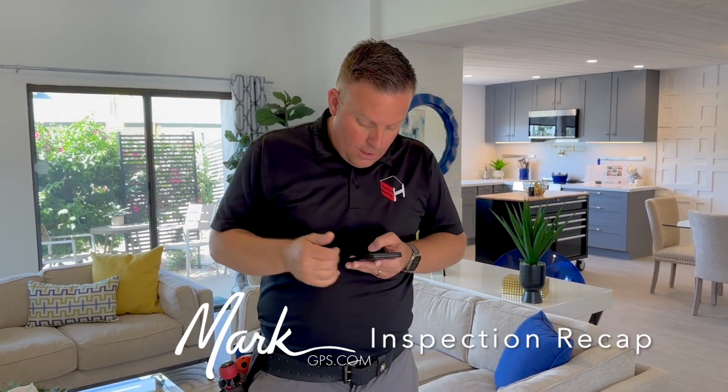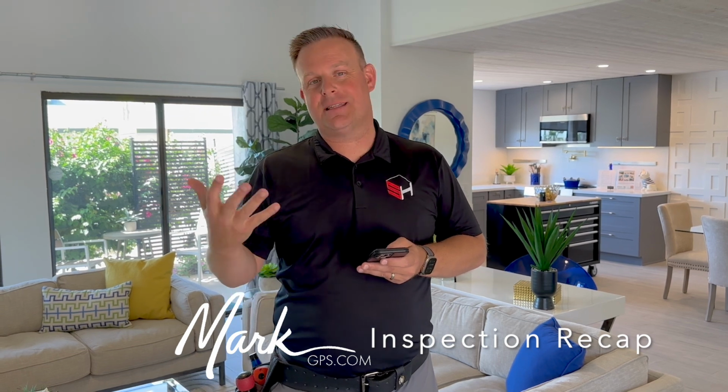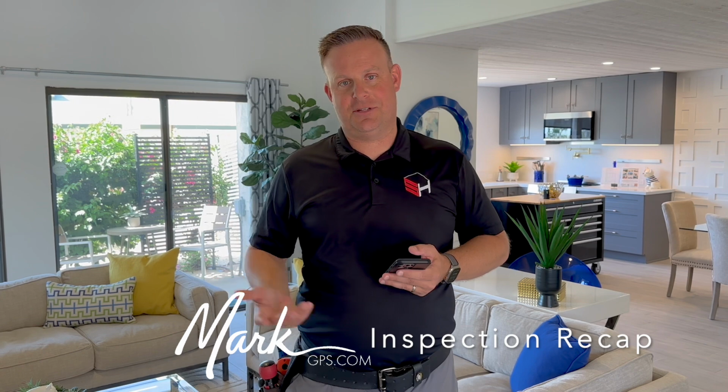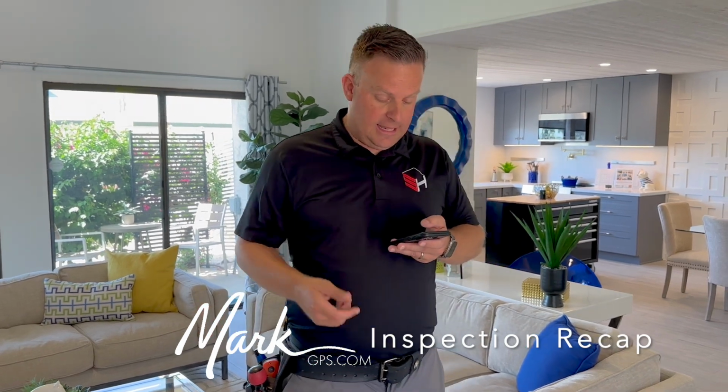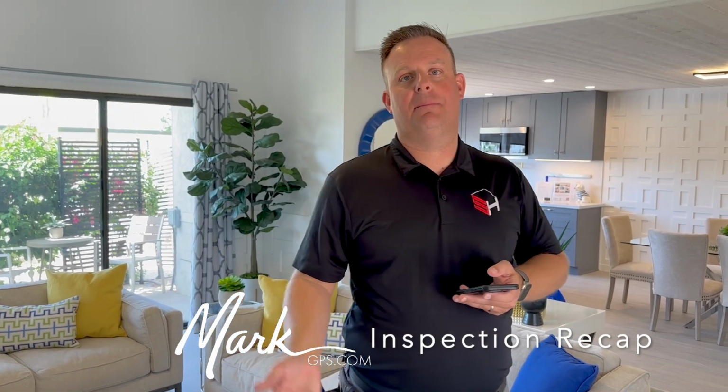Okay. Water heater, everything looks good on the water heater. It's strapped. We're missing a sediment trap, which is a little gas pipe that goes on the gas line in case there's any debris, which is very typical. It just became code like 5 or 6 years ago. That's why they haven't changed it. Okay. And then it's missing a pan underneath it. More or less one of those things down the road. When you change them, put the pan underneath it.